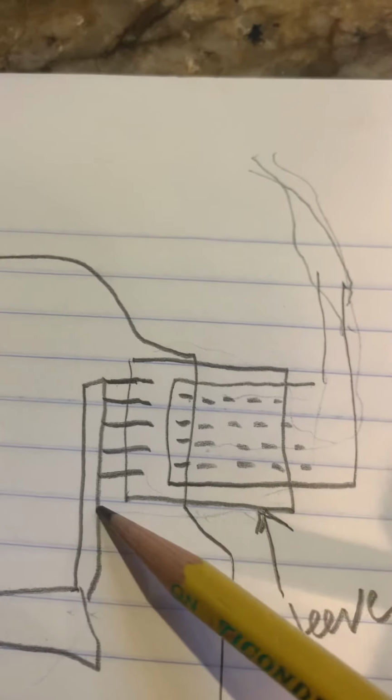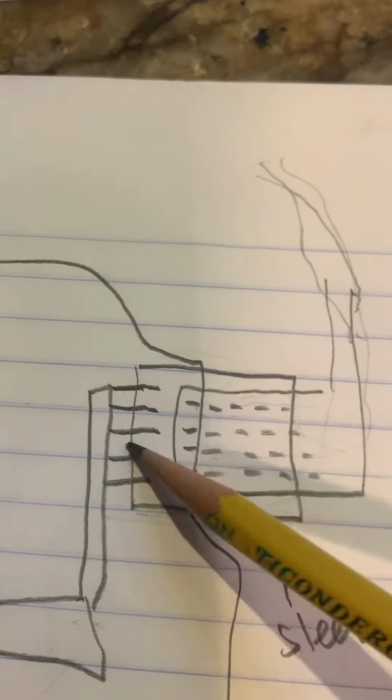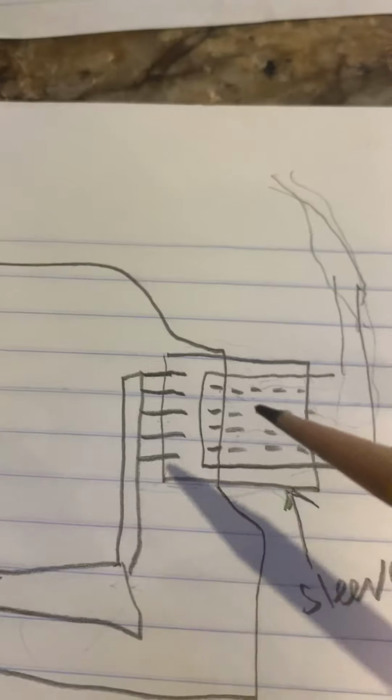The first mistake happened, I think, with the transmission shop, and it's a known issue. This is a square part, the sleeve. This is removable, and to remove the computer and service underneath, you have to get the sleeve out. I think what happened is we noticed this sleeve wasn't fully seated. If this sleeve isn't all the way in, then these wires and this connector aren't all the way in, so these wires never fully connect. There isn't full penetration of these wires. I think the transmission shop was the first place, and they started by doing a transmission service and created this problem.